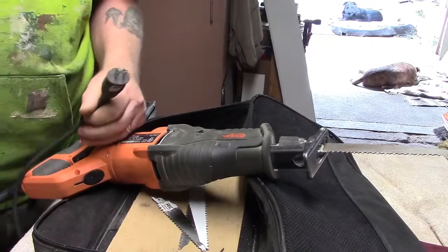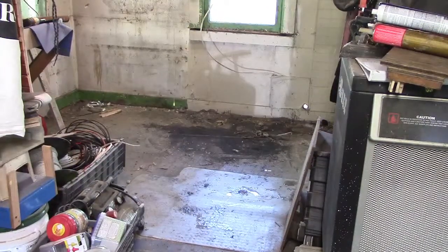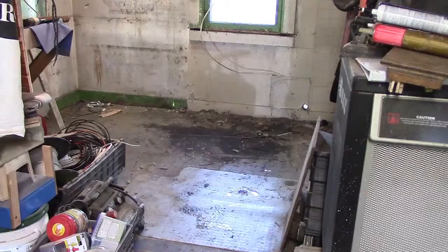So like I say, I'm going to cut out a portion of the floor over there, not the floor, but a portion of the wall at the baseboard, probably 2 sections. Now I don't know if that's 24 or 16 on center over there. So if it's 24, that'll be fine. If it's 16, I'll do 2 of them. And that'll give you a pretty good idea as to getting a level. And then I'll come along the other side that you're not seeing over on this side here to my right, and do the same thing in that corner to give me an idea on that, just in case the garage may have settled on one side or another.